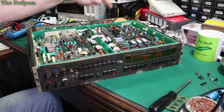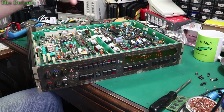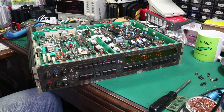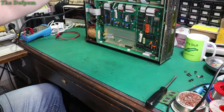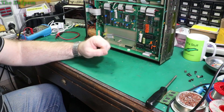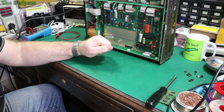So I need to look at doing that adjustment. It looks like it's been wound all the way out, which wasn't the case on my other unit. The voltage is supposed to be 1.05 volts at the test point over here — it wasn't doing that; it was putting out a waveform. So chances are this is going to be the same problem. Let's have a good look around and check all these other plugs to make sure they're all plugged in. Everything appears to be plugged in on this side; only stuff on the other side wasn't plugged in. This actually looks more promising than the other unit was.